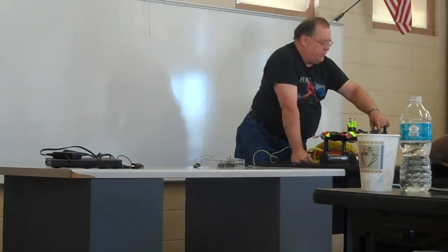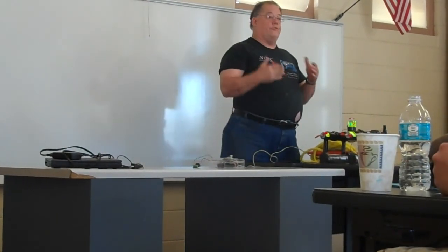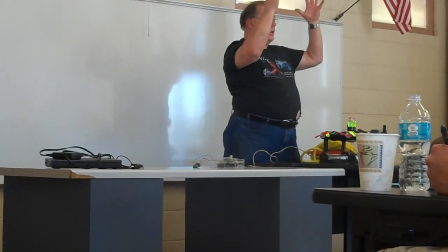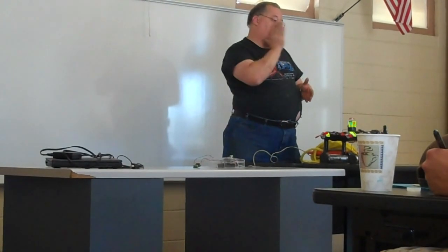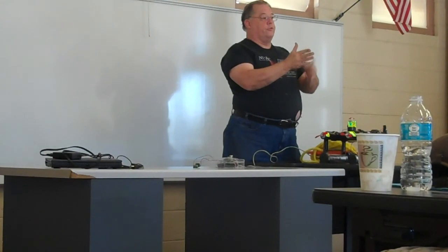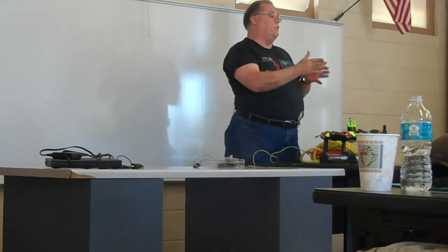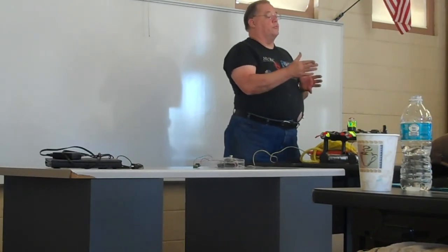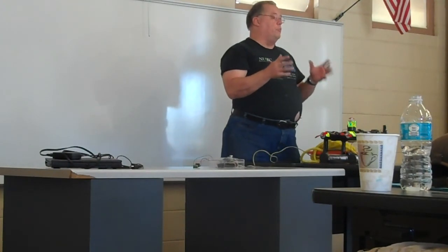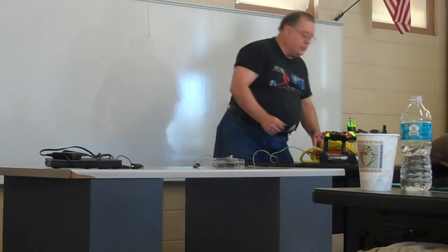The laser is mounted as close to the camera as possible, so that if I cannot see the illuminated dot against some object that just shines up into the sky, it will be close enough along the side of the camera that the scattered light of the beam should still make a visible line. And then by lining up the line with the visible target, it should be possible to illuminate the buoy much more accurately than trying to boresight the camera or have an offset and try to figure parallax.